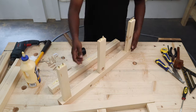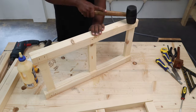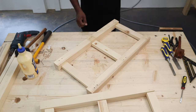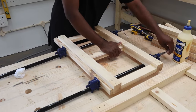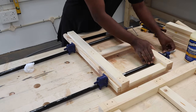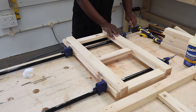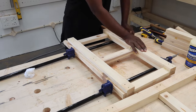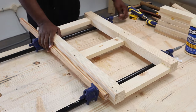We fixed the three shorter bracing pieces on each pair of legs of the kitchen cart using the dowel pins, so both sides of the kitchen cart were ready individually. We clamped them using pipe clamps and left them to dry. Note that when using pipe clamps or any clamp with a hard surface that touches wood, use a flat scrap piece in between the clamp and the actual piece you're making — this is to avoid any pressure marks on the wood from the clamp. Pine is especially susceptible to marks.